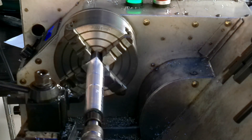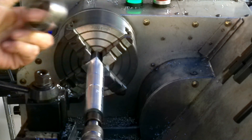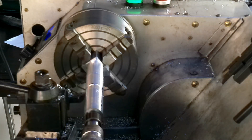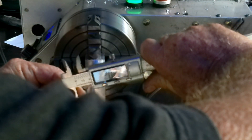I forgot to mention — while I had some downtime during the workshop renovations, I mentioned earlier that I might replace the bearing up the back of the spindle. I've replaced it with a tapered roller bearing, and it appears to have gotten rid of a lot of that shuddering and shaking and grinding I was getting. Very happy about that.